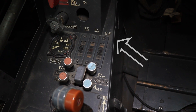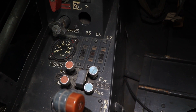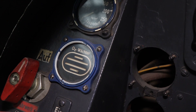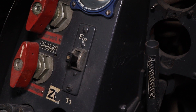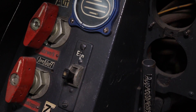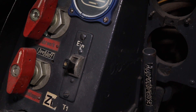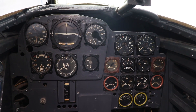The light indicators numbered E5 to E7 give you a visual return on the gear deployment — port, nose and starboard. Oxygen flow is indicated by the lower blue dial, and the top two show the reserve of oxygen. The top red swivel is for the emergency gear release and the lower one does the same for the flaps. The handle to the right is the front wheel brake. Behind it would be the usual spot for the clock, missing here. The flick switch in the middle could be for the rocket assist takeoff, though it has a label saying compressed air — maybe it had a different use in this model.